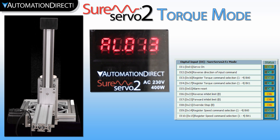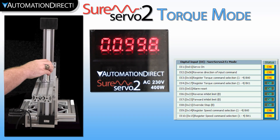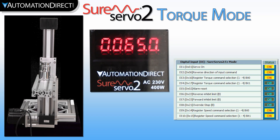Let's output a 65% torque level to start the motion base moving upwards. If we add a 1kg weight, we see a reduced speed as it comes to equilibrium at 65% of torque. Now let's add another 500g of weight, and we see that since it wants to stay at the 65% torque value, it decreases speed to compensate, and in this case has come to a standstill.